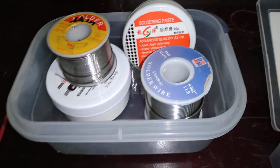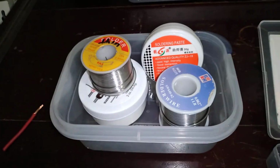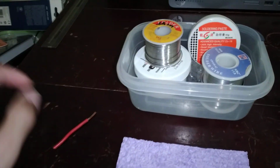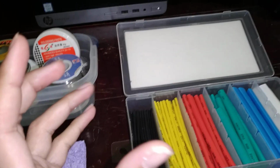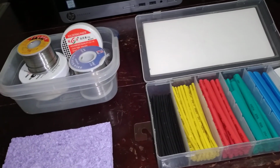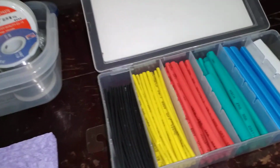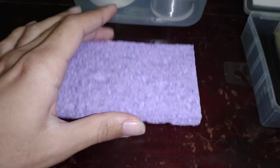What I usually do is, if I'm soldering a terminal or something to a wire, I slide on the heat shrink tubing first, then I solder, then I slide the heat shrink tubing over the soldered ends, and apply hot air using the rework station. Heat shrink tubing becomes slightly rubbery, like wet plastic, and it forms an airtight, and in some cases, if you're lucky, watertight seal over whatever you're trying to protect. That helps to prevent things like corrosion and dirt getting into your projects.